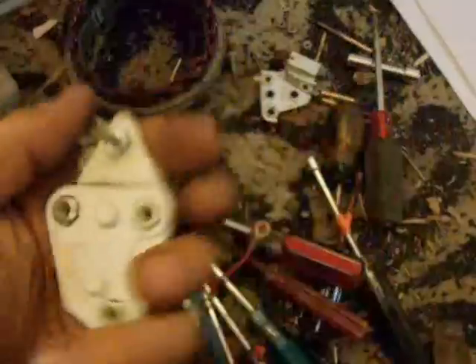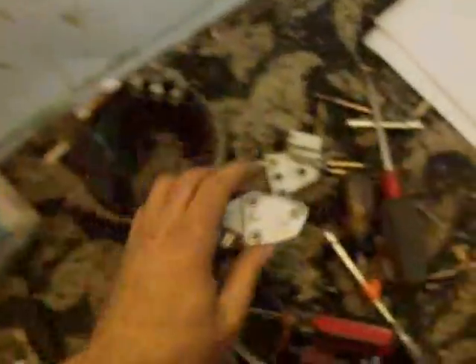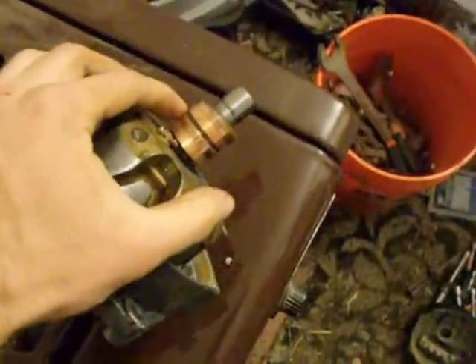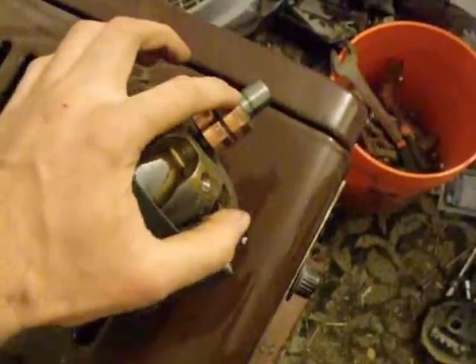That's what's in here. You can pick that up at your local alternator shop, probably for 25 bucks for this regulator. One more important thing: the alternator that you build out of this — this rotor has to test max load 4 amps. It has to be a 4 amp rotor.